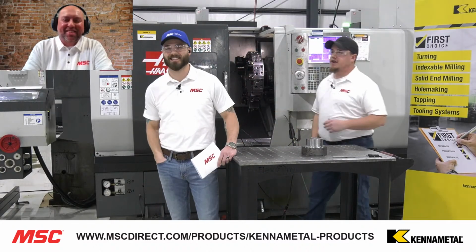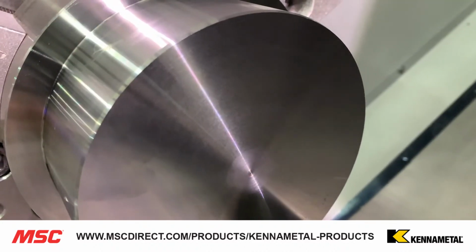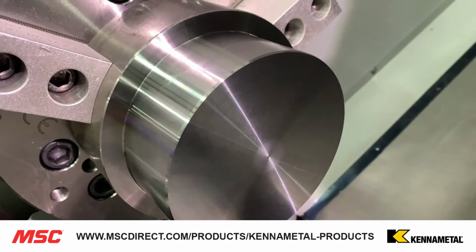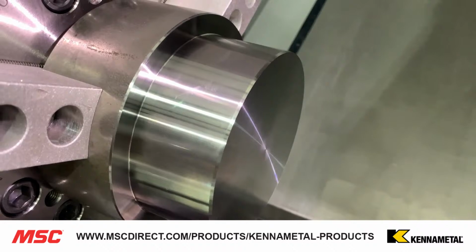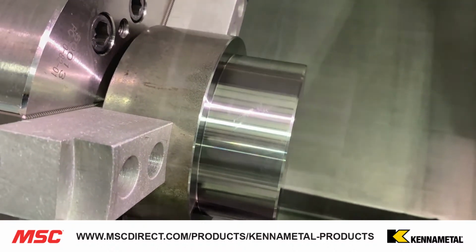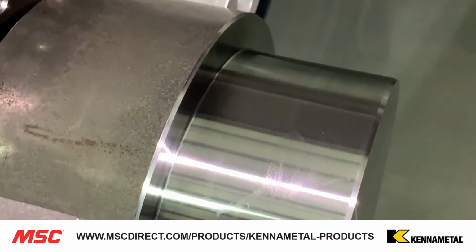Yeah. So creating that capacity, going to that new school program, I mean, it happened in the blinking of an eye. There you go. It did, Eddie, and I apologize. I thought we were still waiting on the finish. That all happened so much faster than the old school method. So you really want to utilize and optimize your inserts when you're doing longer production runs, like you may have in this example, of getting the harder inserts and optimizing your cutting parameters to get that part out quick.